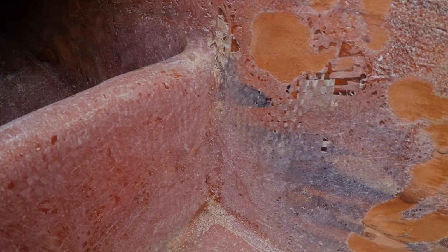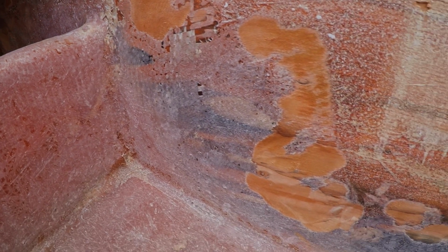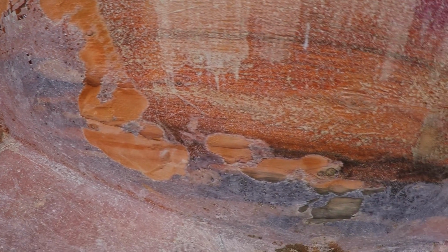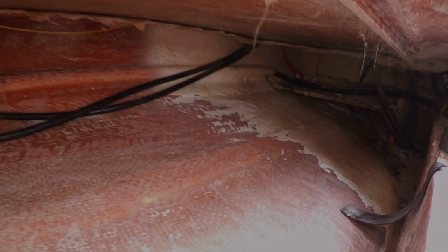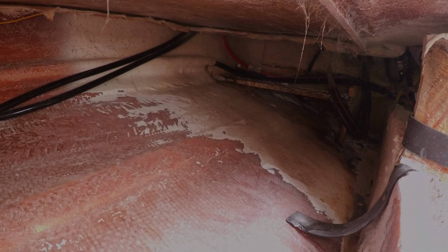The added glass and room needed for airflow has me concerned about the size of the replacement tank. I will have to complete all of the repairs prior to ordering a new tank. I removed the gel coat between the bulkheads as far as I could easily reach. The exposed wood from the strake is clearly visible. There isn't a lot of glass there.